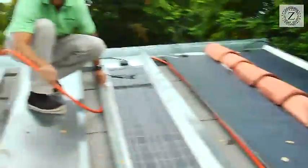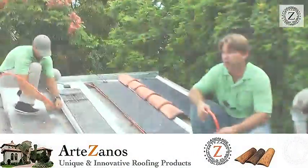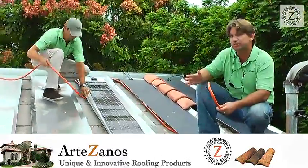Roof tile has some advantages and it's extremely flexible in the field area for installation. The metal pans further that installation effectiveness, and you are able to capture whatever advantages you have for the solar energy systems. It just makes absolute sense — it economizes the system, the system is actually cheaper. It should be used as a retrofit over existing asphalt shingles so that you circumvent the demolition and don't send the demolition debris to the landfill.